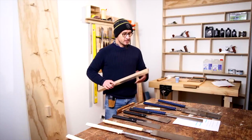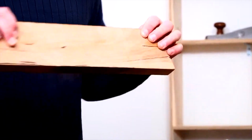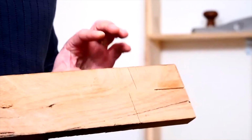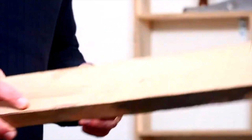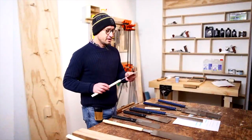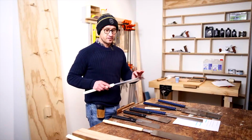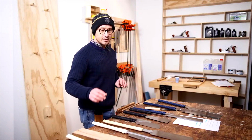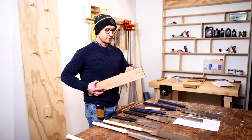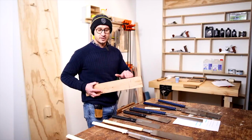So yeah, you can probably see, I don't know if you can see where I've gone along earlier before, but there's quite a difference in the thickness of the kerf that you get with the different kinds of blades as well. So the Dozuki, which is the full spined version with the 0.3 millimeter plate, gives you a very, very, very fine kerf. So perfect for me for making fret slots. You can either put veneers or something like that into those slots.